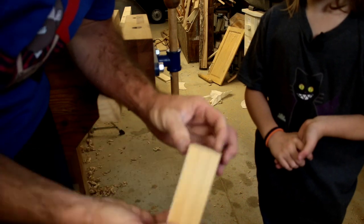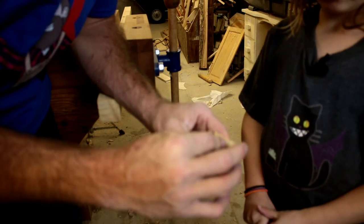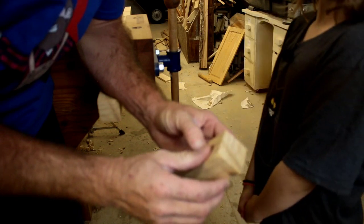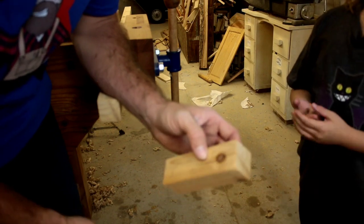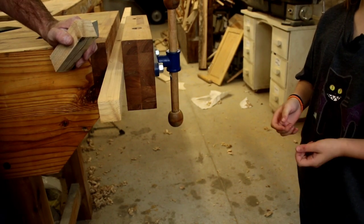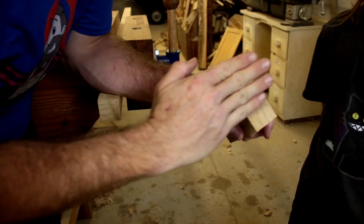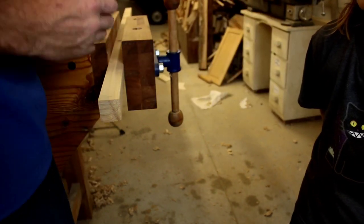Let's see what you did — actually very nice and straight. Look at that. You can see the cut I made — it's nice and flat. So that's what happens if you can keep the saw straight the entire time. Yours was a little wobbly, so you can feel how it's a little bumpy. But for your first cut, that was actually really good — better than most people do. Better than my first cut too. I just started on the top and cut to the bottom and saw it was all messed up. Because you were keeping your lines, you can actually see where some cuts were angled — that's what keeps your lines straight. Really nice cut, good job!